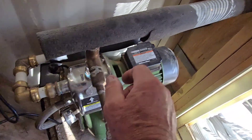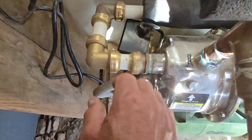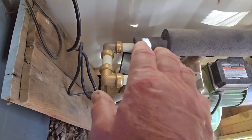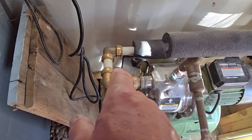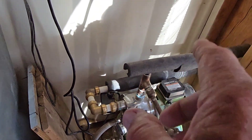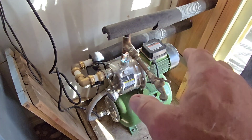Don't play around with the settings inside the pressure switch. Yes, you can crank them up and down, but don't do it — those things are factory set for 45 PSI and they are not wrong. What is wrong is your check valve, your gauge, or your air pressure; those are the main problems.